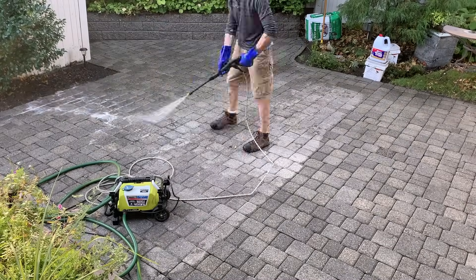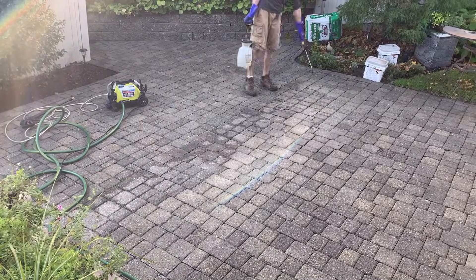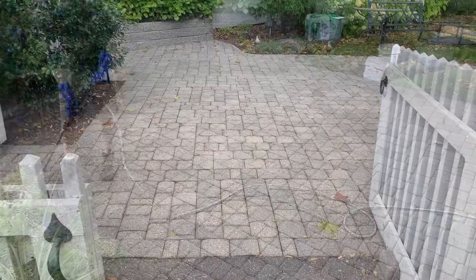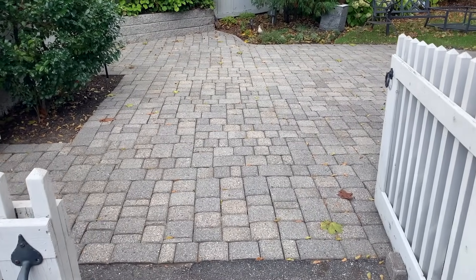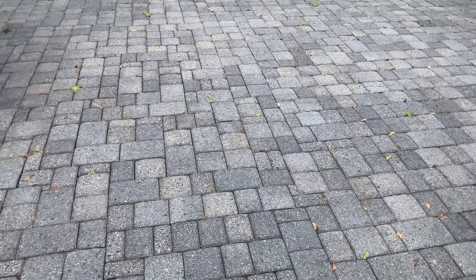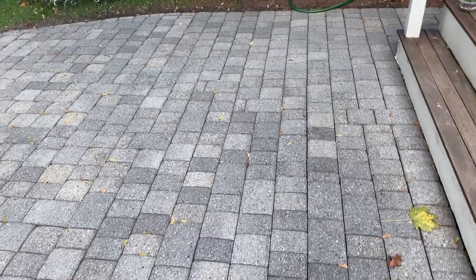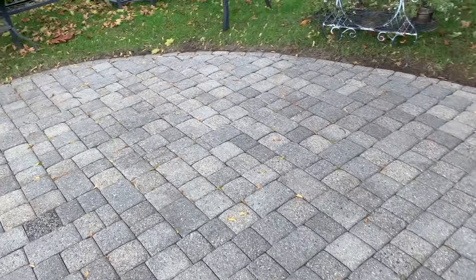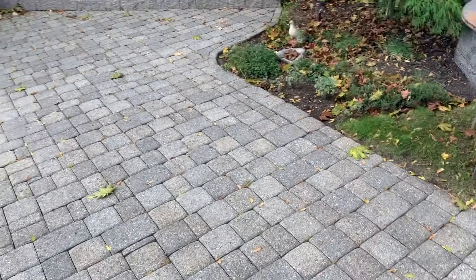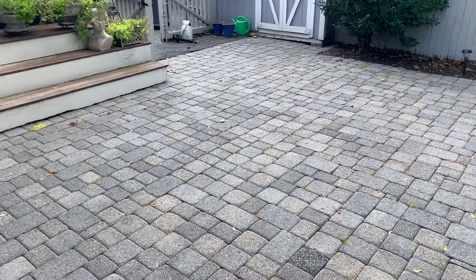My only regret was not having a larger pump sprayer — I must have refilled that thing 10 times. 30 Second Cleaner isn't supposed to harm grass or plants when rinsed well, but either way, I'm sure my other half wouldn't be happy knowing I was spraying it around the herb garden. Once rinsed, the paver joints need to dry thoroughly, and then it's time to fill the gaps with polymeric sand. Depending on what time of year you're doing this project, you'll want to have tarps available — while the pavers dry, you don't want mother nature dumping maple helicopters, leaves, acorns, and other things between the pavers. I realized that a little late, so I had to do some additional cleanup with the putty knife and shop vac, and even used the blower. A few days later, once everything was dry, it was time to fill the gaps with sand.